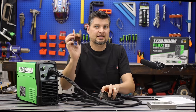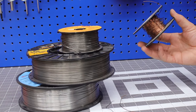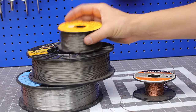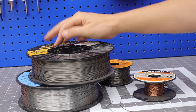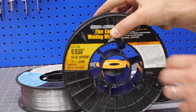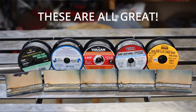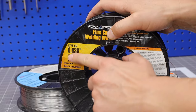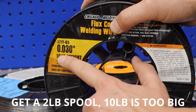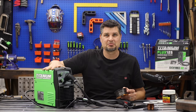You do need to buy wire — not the solid core wire, the shiny copper-looking stuff that's for MIG welding. We can't MIG with this machine. You want to pick up the gasless flux core wire, also called inner shield wire — it goes by many names. All you need to know is it's not the shiny copper stuff. It's the more expensive wire, but you don't need gas. As far as size, pick up 0.030 and that will get you through almost any project you'd have to do with this machine.